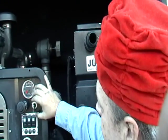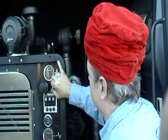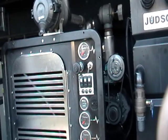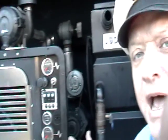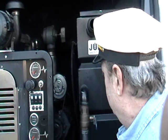I'm going to start it up and show you where the RPM was when it was designed to make heat, then what it will be going forward. That's just idling there. Now I'm going to take it up to the recommended RPM — and now I'm going to take it down. As you can see, it's a lot quieter and using about half the amount of fuel. I think the extended life of this engine is going to be amazing, because half throttle means roughly twice the life of the engine.